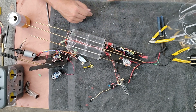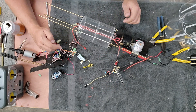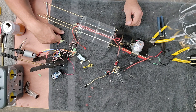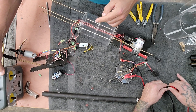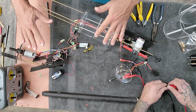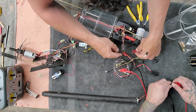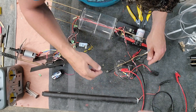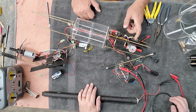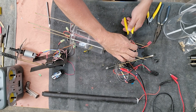For fun, what we're going to do is bypass the entire stern section of the boat altogether. Disconnect the power and see if we can run power here. We'll see if we can get this speed controller going with a dose of juice. Go through the components one by one and see what's going on. We got a little bit of progress — we got the receiver talking to all of the servos. That's all working. Now we just need to connect the power here. Let's see what happens. And we pop the fuse — short. I have a hunch it's this electronic speed controller. Let's just see what happens when we eliminate it from the circuit.